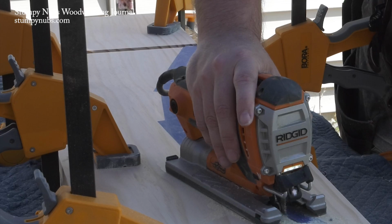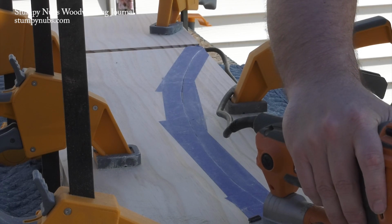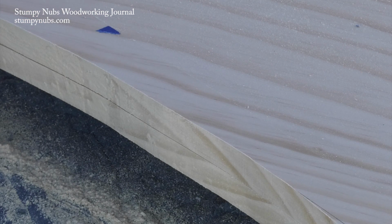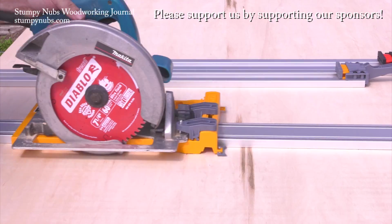I also clamped my 2 side panels together so both curves would be roughly the same. Cut carefully, trying to make a nice smooth curve. You'll have to do some hand sanding to even it out when you're done, but I think it's well worth the effort. In our next video, we'll start our assembly and we'll put on a finish. When that video is available, I'll put a link in the description below this one. We'll see you then.